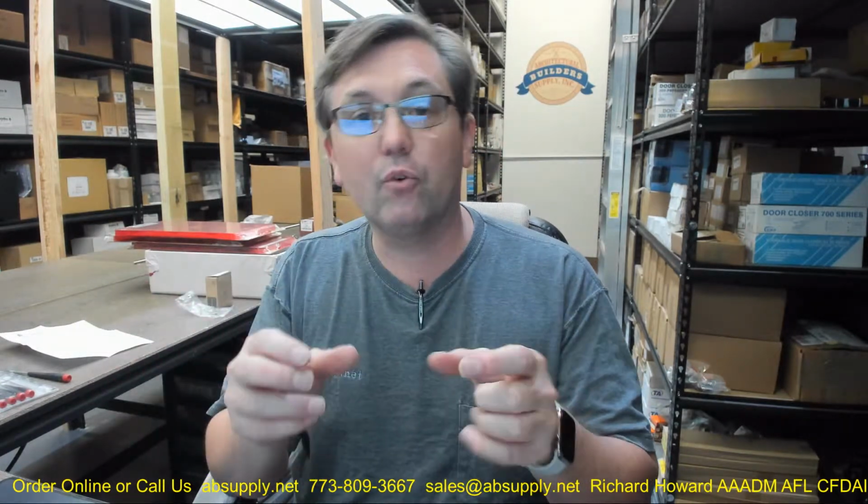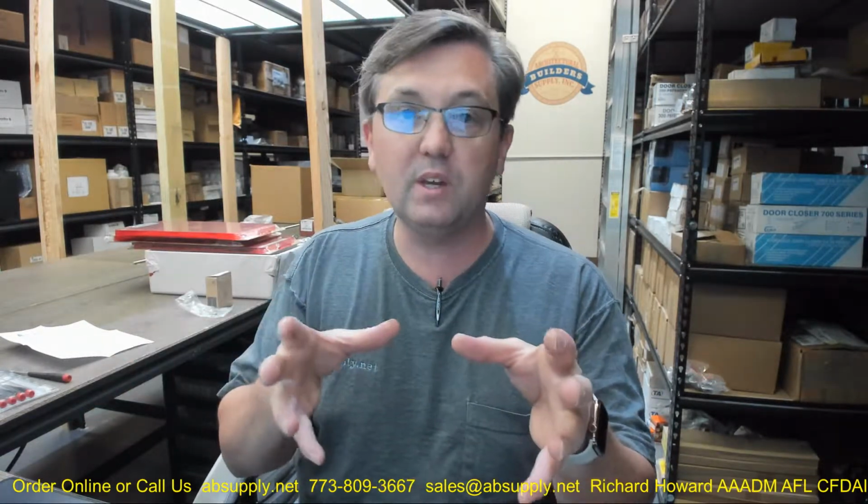So a Yale lock was supplied with the new fire-rated wood door. The client's existing Everest B family small format restricted cores were going to be used, and rather than investigate if an Everest small format B family is going to work in a Yale cylinder, which it would, I just didn't investigate if there was a housing from Yale for their Yale lock. The low-hanging fruit was the fact that I had the Schlage part numbers memorized, so I supplied a Schlage housing with a Yale cam. It would have been the long way around, no doubt, but that's exactly why this cylinder housing is supplied.